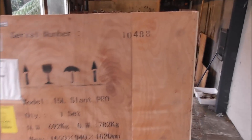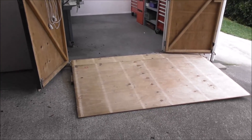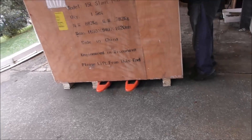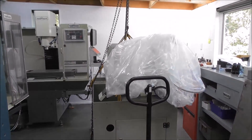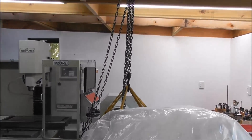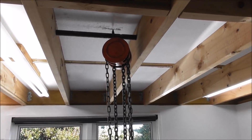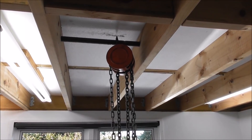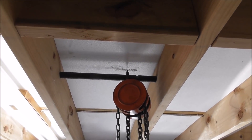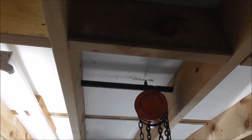Just taking the lid off to have a peek inside. I've got a bit of a ramp here — a couple of bits of half-inch ply on some rails — so we should be able to wheel it up with the pallet jack. When it came to lifting the lathe off the floor to remove the pallet plate underneath, I didn't want to buy the lifting kit because it's just a one-off use. I've used a chain hoist plenty of times — they're very cheap, very safe, and you can use them for all types of lifting and dragging tasks. So I just bolted a piece of steel between two of the rafters; that will take at least a couple of tons, so I'm not worried about the load with some 12mm cap screws.